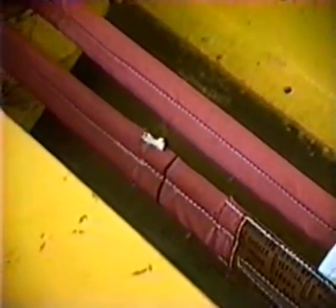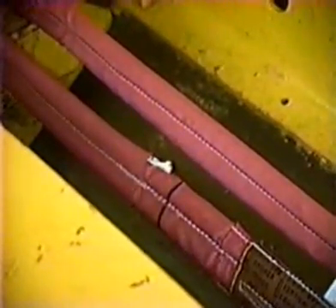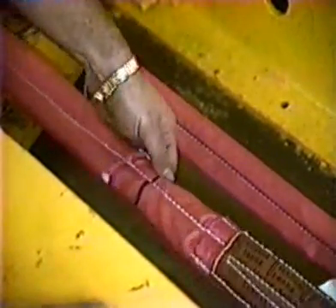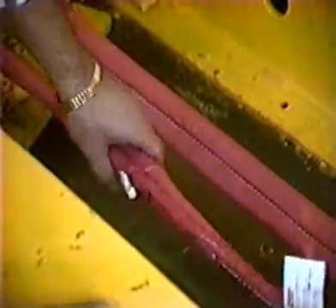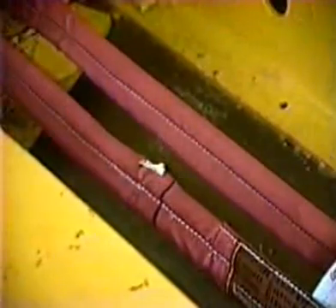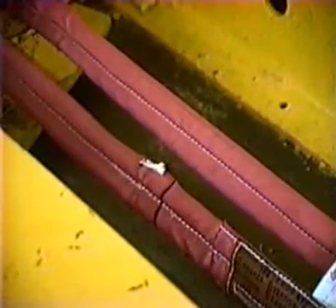You can see that one of the tattletales has actually disappeared underneath the cover. What we suggest to some users is that if the tattletales are more than half an inch away from the line, or if they're totally gone and disappeared, the sling should not be used. Now, what I'd like to do — as ridiculous as this may seem — is to go ahead and load that sling up again and see if we can get another value.